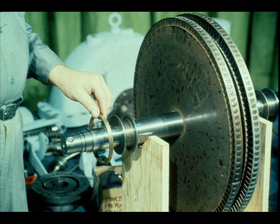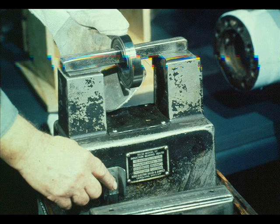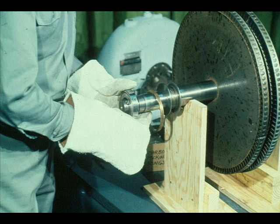The next step is to slide the oil rings back onto the rotor shaft, placing them in the approximate position of operation. This is the new replacement bearing for the old rotor-locating bearing that was discarded during disassembly. The workman is heating it on an induction heater so it can be reinstalled on the shaft. Once the bearing reaches the required temperature, the workman slides it onto the shaft. The shielded side of the bearing is facing the governor end of the shaft — this is an important point, don't forget it.